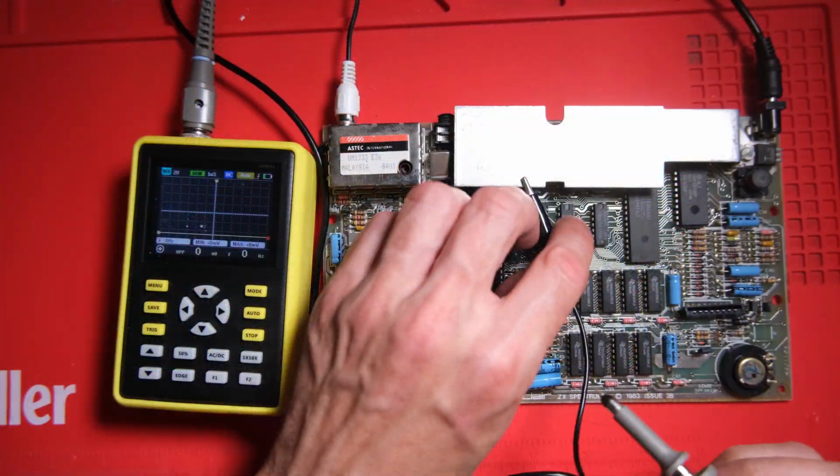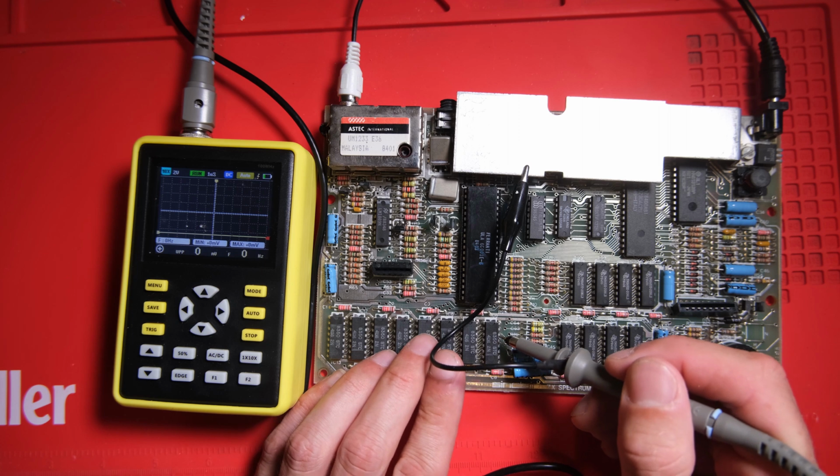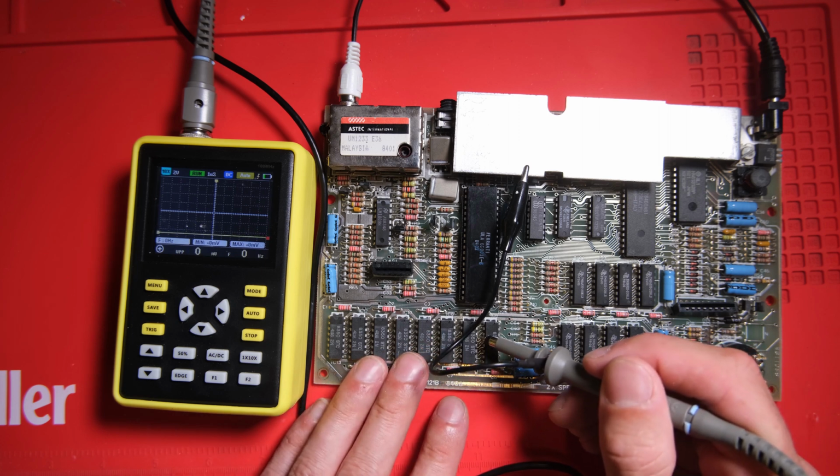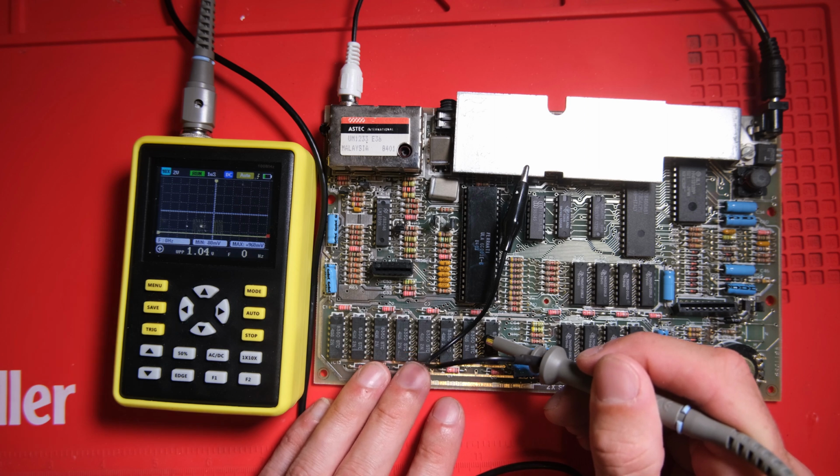Rerunning the diagnostic ROM still looked the same, but it decided it was a different RAM chip causing problems, and then started to go really crazy. So I'm starting to think it might not be a RAM chip at all causing the problem here. More likely it would be the CPU, I reckon.